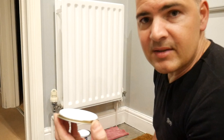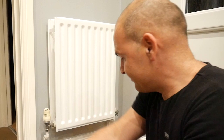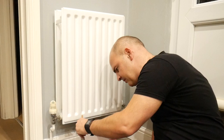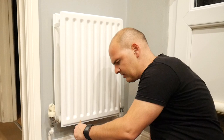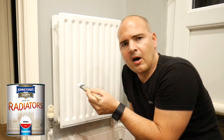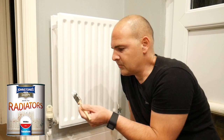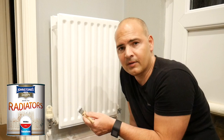You can clean up messes easily, which for me is a godsend because I'm a messy sod. I've probably got the worst brush in the world — it's a one-inch brush, 25.4 millimetres for you perfectionists, and I just washed it so it's still a little bit damp. This feels a lot thicker than the primer — considerably thicker. The last time I did this radiator was with Hammerite radiator paint, which was a gloss-based formula that left a nice enamel finish but went yellow really quickly. And because it was gloss-based, I had to throw the brush away and spent ages chipping mess off the floor, so hopefully this will be easier.